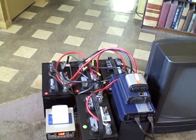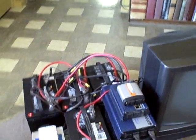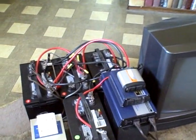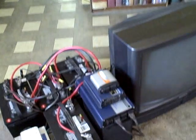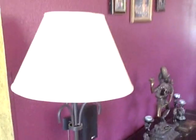These 115 amp-hour batteries balance out well with a full day of sun. A three-panel set from Harbor Freight Tools is about $200 — they'll sell you three one-amp panels with pretty much everything you need except the battery and inverter. So four batteries hooked to four sets of panels, 12 panels total, three in a set, with extension cords running around the house.